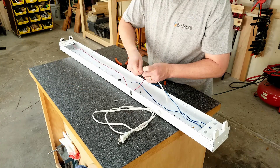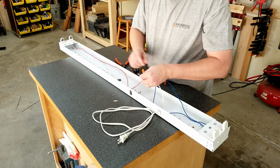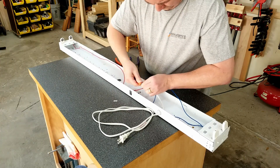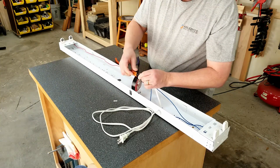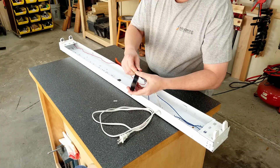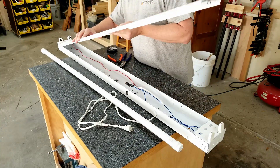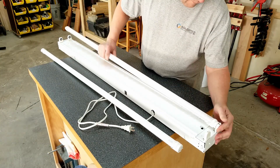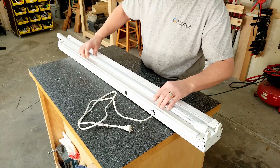As you can see here, one end of this fixture already has both of the sockets on one side wired together to one lead, so I'm able to use a wire nut and just wire that up to one side of the extension cord. On the other end there are two separate wires — one for each of the sockets — so I simply take a wire nut and wire those together and wire it to the other lead coming off of the extension cord. Then I add a little electrical black tape onto the wires to provide some strain relief. There really isn't a positive or negative when it comes to these LED strips, so it doesn't matter which side of the extension cord you wire to which end.